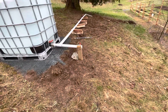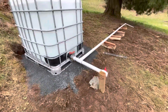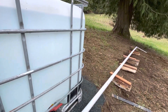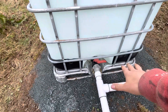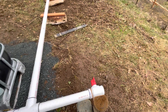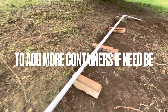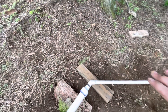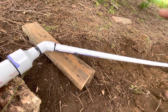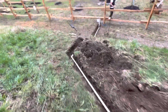Good morning folks. This is day two of the water project, the first water project. We have our second one coming relatively quick. What we've done so far — my dad and my siblings did while I wasn't here — the tank you've seen has been placed here. We've gone and got supplies and pipe. We've hooked on to the end nozzle of the IBC tank. We've decided to tee it and put a valve here just for a flush out if we need to, which it might need for silt that may collect in there over time. Then we've gone two inch for a little ways, and we've got a reducer coupling here to go to one inch, to hopefully build a little bit more pressure as it travels down the hill using gravity force. Then the one inch travels pretty much the entire rest of the way.